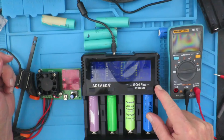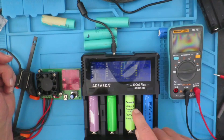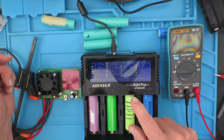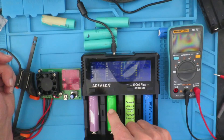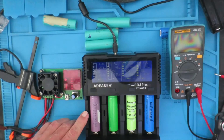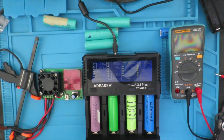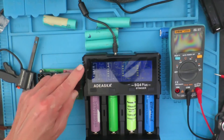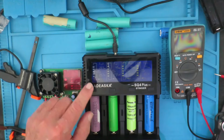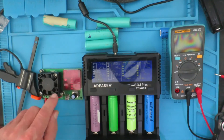The results of this charge are quite interesting. It's no surprise that our lightweight friend on the end only managed 379 milliampere hours. The Panasonic, allegedly 2000mAh, came in at 1863 — in the right ballpark. The Sony is a little disappointing: supposedly 2200mAh but only 1303mAh. The LG EP21, nominally around 2600 milliampere hours, came in at 1748. Now we're going to go through discharging these cells. This one is particularly intriguing — it has a high capacity reading but also a high internal resistance.